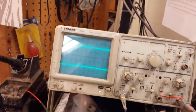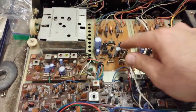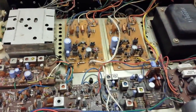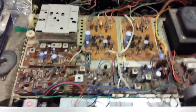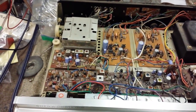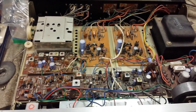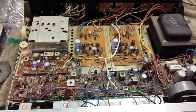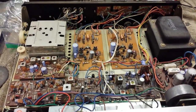The next thing I want to do — now that I've got it so that it's mostly stable — we'll re-solder the other board. I want to check some of these Panasonic capacitors which have a fairly high failure rate in these machines, and that's simply done with an ESR meter. So let's re-solder the board and then show you about checking capacitors.